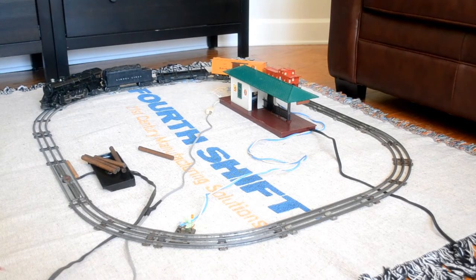That's going to end that, and I want to give you a couple of comments. I thought it was going to be fairly easy to just change taps on the transformer, but I had to put some diode bridges in series with it to drop the voltage from 15. This locomotive turns out to have a narrow band where it runs well — starts at 12 and pretty much at 14 it's running flat out. So there isn't much room to set your voltages; you have to kind of cheat with some semiconductors, and that's what I did.